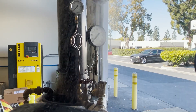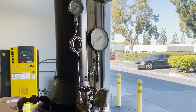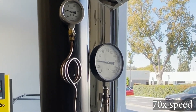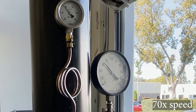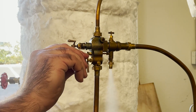You'll see it close in five, four, three, two. We're going to build up pressure to around 75 to 85 psi before we get started. Now we're testing the injector at 85 psi.